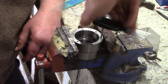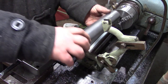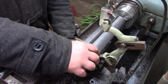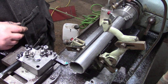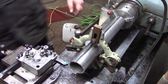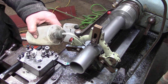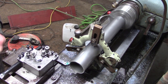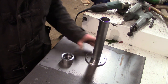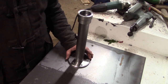Happy tap tap. I didn't really want to stick this in the lathe, but it's the easiest, fastest way of getting square ends on it. I'm kind of relying on everything - the features that I machined into the parts and the square ends on this tube - to get the axle lined up. By this stage the pond pump in the lathe had stopped working, so I'm using a squirty bottle again. There we go, that's the axle tube.